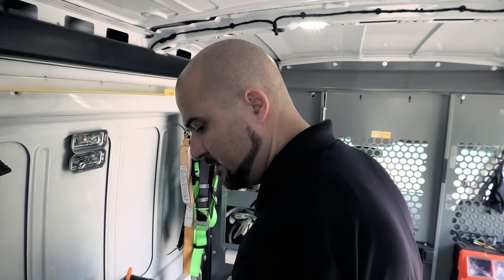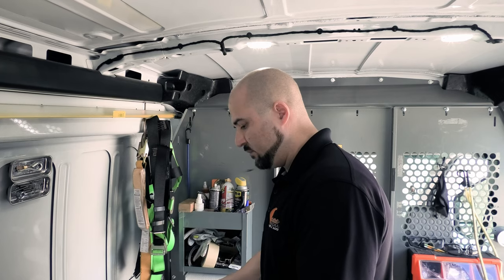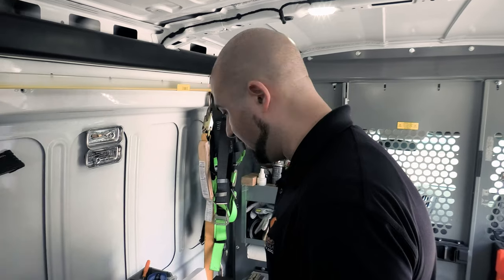We're getting moving along here. I just cut almost all the keys. Lucas is putting in the remainder of the locks that we've re-keyed and we're about to pack up and head to the next one. So we finished up the first job — it was nine master re-keyed cylinders, made about 25 keys, stamped them all, swapped some levers around. Now me and Lucas are going to head on to the animal ER clinic, where I believe we're just going to re-key some locks and maybe do some additional work.